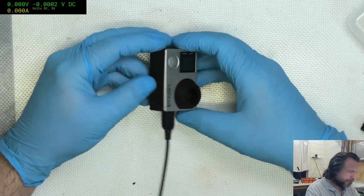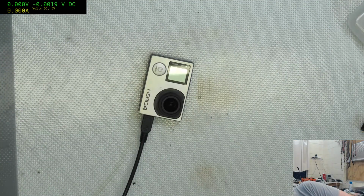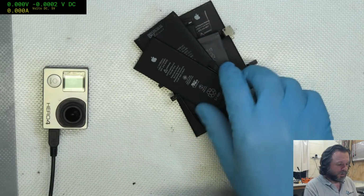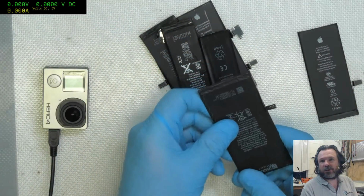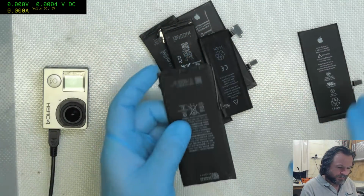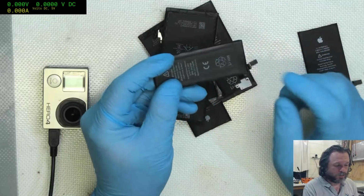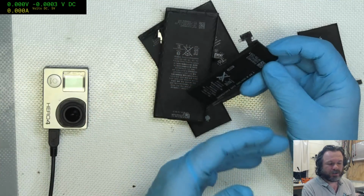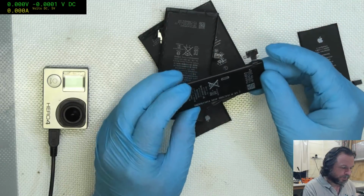Tinkerman, usually if the cell is physically looking problematic, then it's a bad start. When you're starting at a low voltage, it's not so much a problem. The biggest time that you often get explosion effects is when people overcharge beyond 4.2 volts, or they charge at an excessively high rate. It doesn't tend to affect these packages too much because a lot of these have safety boards in them. They've got little circuit boards, like this one that has a built-in controller that limits that kind of thing. It still can happen if you get a faulty controller board, but not as likely.